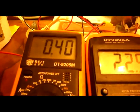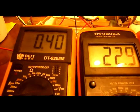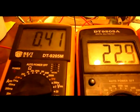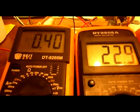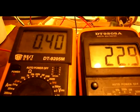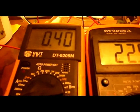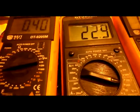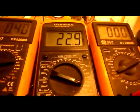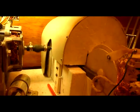And over here, nothing's changed, I don't think. Well, maybe a little. Not much. Okay, so I've reached a critical null point where when I power up, it's actually speeding up just a tiny bit, but you can't hear it. So at the 25th terminal, about 1200 RPMs with 10 poles. I got 10 poles, magnet poles on that wheel, on that rotor.